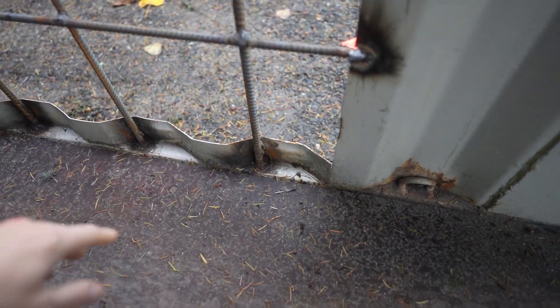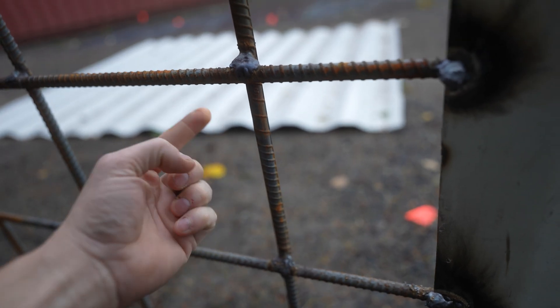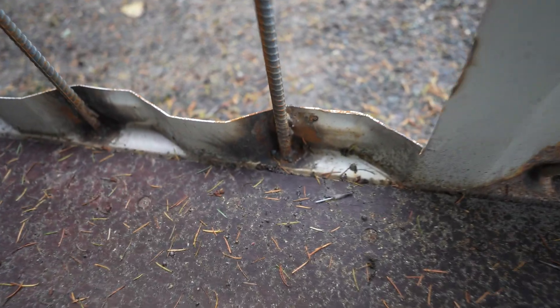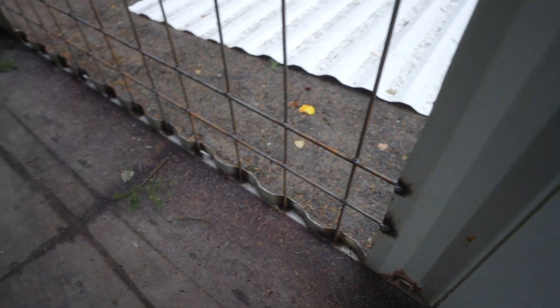In terms of the rebar, we're running it every nine inches — meaning from this point to the top of this rebar, and then from this rebar to the next, it's every nine inches. On the corners of the container structure it's about 11 inches, and then every nine inches after that. We're going to keep going nine, nine, nine all the way up, and also have that opening from the top down at nine inches. That gives us good airflow — we're going to have a lot of air being pushed through the rebar.